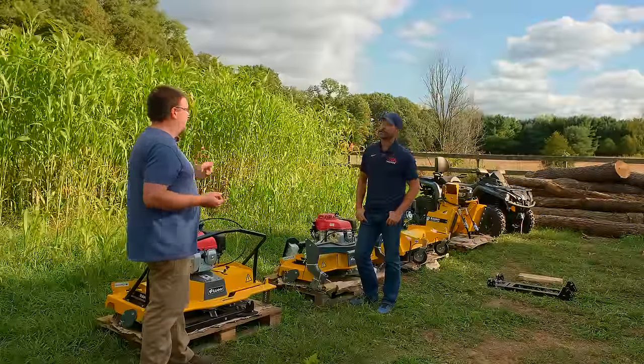Here's the Ultratech earth moving trailer. It works for moving firewood too, though dumping it isn't as easy because of the tipping door. The difference between this and the regular tandem axle trailer is that the axles are further back and it has a steeper tipping angle — so when you put dirt, sand, or earth in it, load towards the back first for easier tipping. The tipping door opens to let you spread earth. It has a solid frame on the bottom, a strap for a shovel or earth moving tool on the side, tandem pivoting walking axles for uneven terrain, and a swiveling hitch coupler.